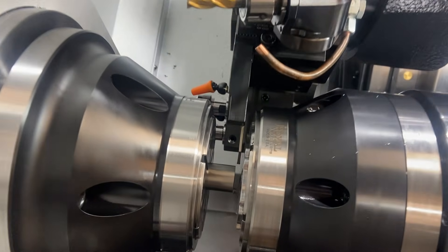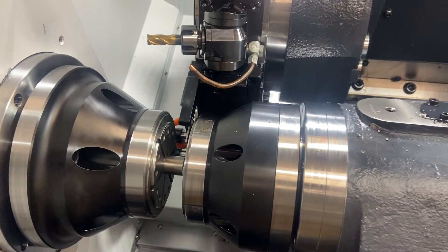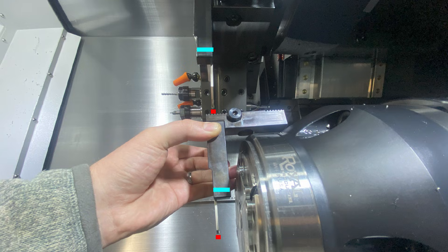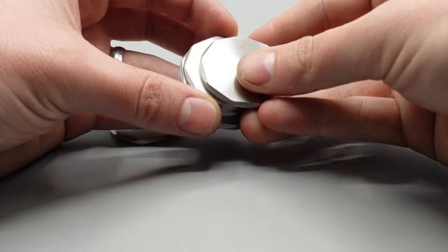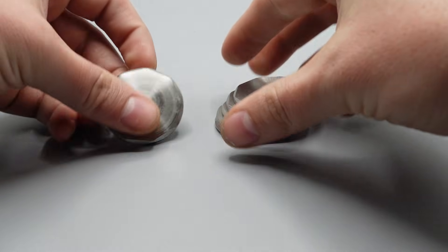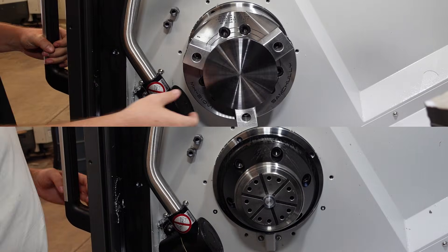I want to talk about the clearances between the two spindles because this is a sub spindle — you can do both sides of the part and pass between them. Here's our ISCAR parting tool. This was one of the first mistakes we had: you can see where the red cutting face is and where the clearance area is in blue. Depending on what you're trying to do, you might not have clearance between the sub spindle and the main spindle. Here's a golf ball marker we made a lot of — the length is very short, and you're going to get a nipple on the end if you don't have the right tooling set up. That's a lesson to think carefully and work with your tooling supplier.